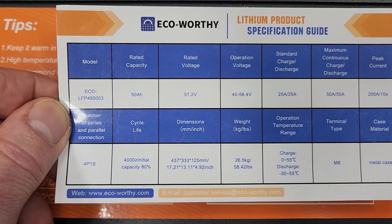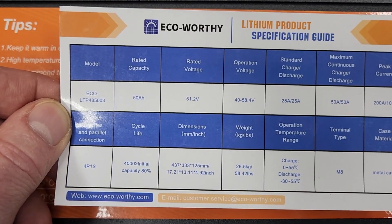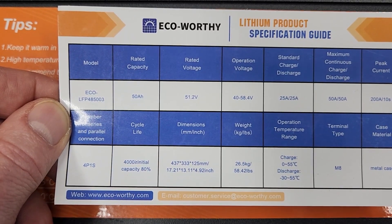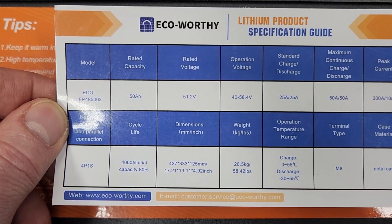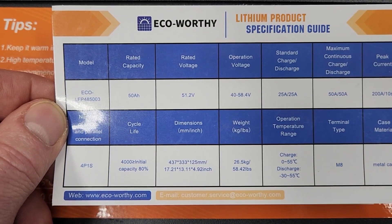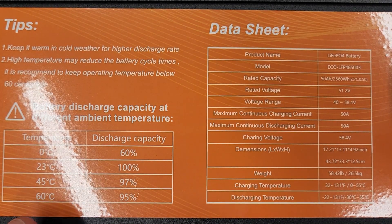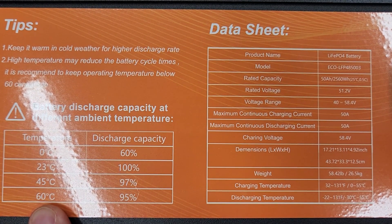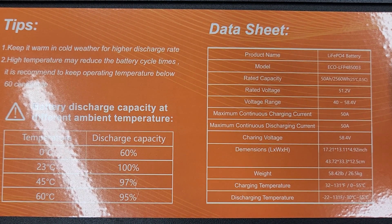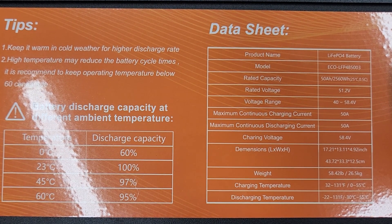I expect I can keep the temperatures under that, and if it does go a little over I think we'll still be okay. High temperatures in general are bad for these batteries, but it's a cost-effective battery and I'm just going to use it and get everything I can out of it. You can see that at 60 degrees Celsius - a little bit higher than 131 degrees - you still get a capacity of 95%. Now it's time to get this charged up so we can do a capacity test and see how well it works.